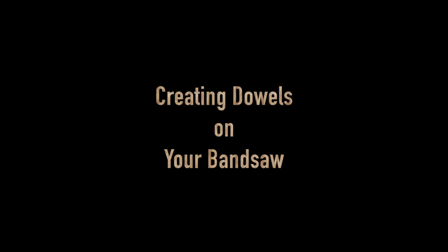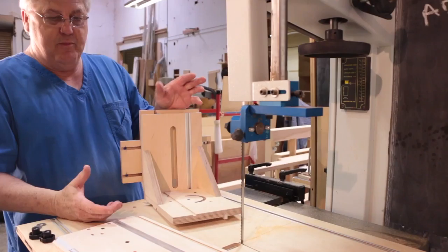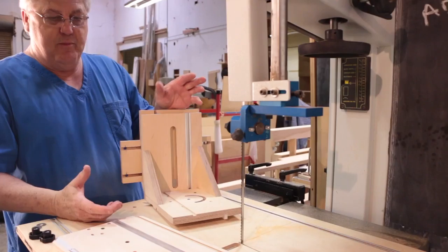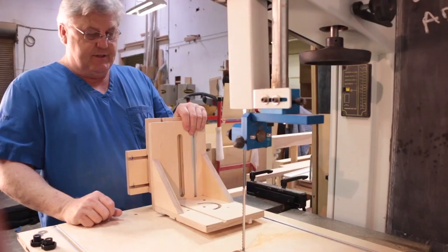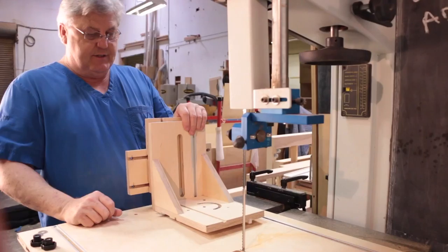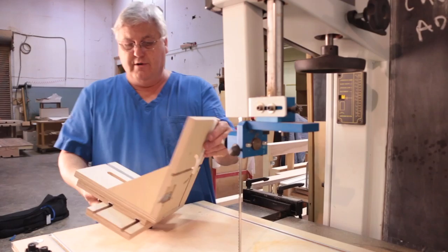The wizard jigs are pretty much a foundation jig. You can use the table for many different things, you can use the sled for many different things, you can use the carriage all together or independently — it's up to your imagination of what you want to hold with it. I was looking at YouTube the other day and noticed there's a guy that makes dowels on a bandsaw. It's pretty straightforward, but he had a bunch of clamps and all this stuff that you already have with this system. I took the carriage and made a couple of pieces you can go up and down with and slide to and fro. If you think about it and put it in a track with your guide runner in there, you can actually do quite a bit.